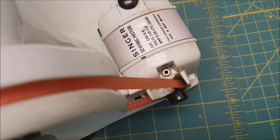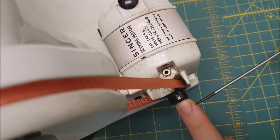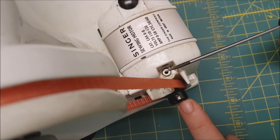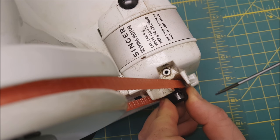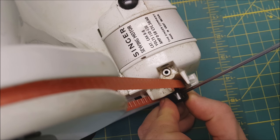One quick thing about replacing belts on motors that have a Bakelite motor pulley. The pulley piece is metal on US motors, but on white machines from the UK, 222s, and even 221Ks, the motor has a Bakelite pulley. Bakelite is very brittle, so the method I just showed — pulling out and rolling down — could crack the pulley. As of yet, there is no replacement for this Bakelite pulley. Instead, you'll notice a little set screw that goes all the way through the shaft. Loosen and remove that screw and set it aside.